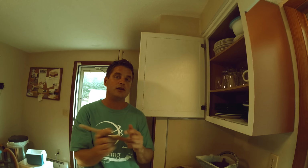But before we do that, whenever you cut it, it'll leave like a jagged edge right there. So the best thing to do is I like to use a piece of sandpaper and sand that down. Now, if you don't sand this down, then this will cut the surface of whatever you're caulking. So you definitely want to sand that down and round that off so that when you apply the gun to the surface, it won't scratch it as bad as it could have because there was that loose piece there.